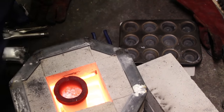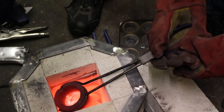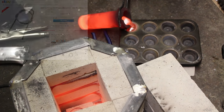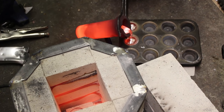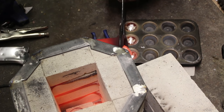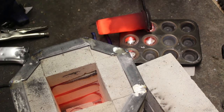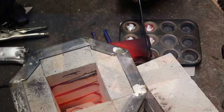This is what's called a resistance foundry since it runs off electrical resistance, and the heating element is a very cheap kiln heating element made for high temperatures that I bought off eBay for only three pounds. This foundry is very well insulated using alumina silica fire bricks, and after running for hours the outside never gets over a hundred degrees Celsius despite the inside being almost a thousand.